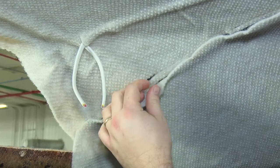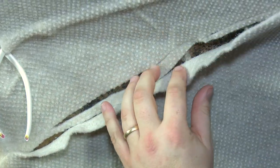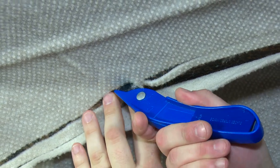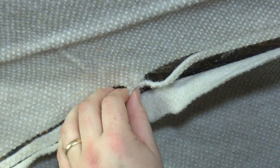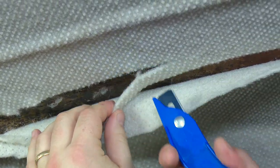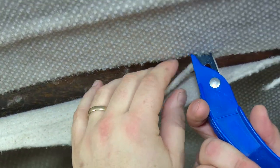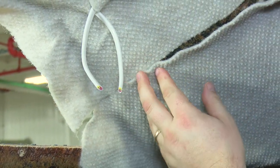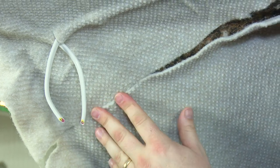Okay, now when you're getting your second side out, just kind of reach up, start to pull it aside. If you get to any areas like this where you can see it wasn't cut real well, just kind of come across it. That way you don't stretch your carpet out like that right there. And this is with a nearly brand new edge. And so now what you can see is we've got two edges that will match up almost perfectly.